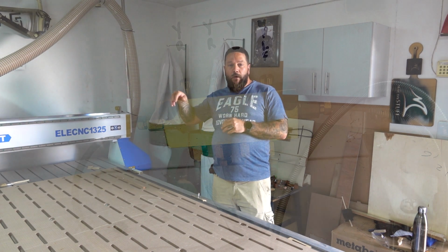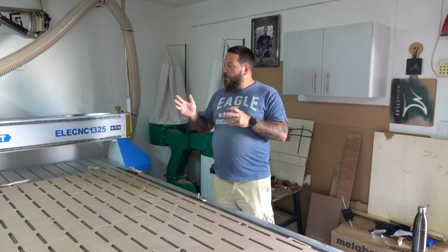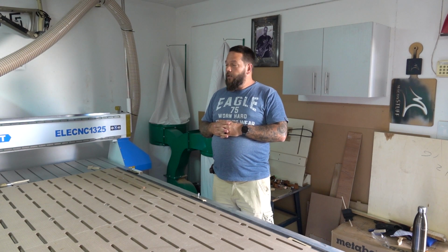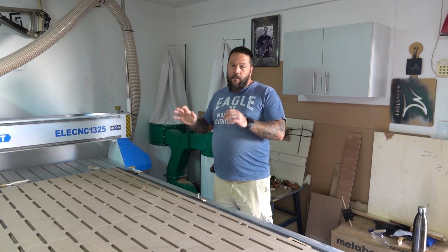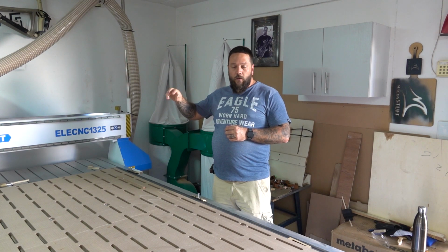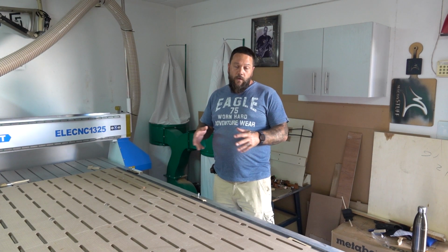Now there are also a bunch of screw valves right next to the reservoir, but unfortunately there's no way to access the inside of the whole X-axis, so it's very difficult to ascertain where each one of those oil lines are going. By opening up the shoulders on the side of the X-axis, I have been able to tug at the lines and kind of figure out which lines are going where. Currently I have got all of the screw valves turned closed just to see if the leakage stops, so then at least I know that that's where the oil is coming from.